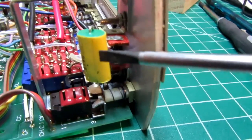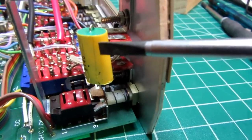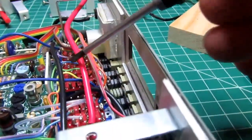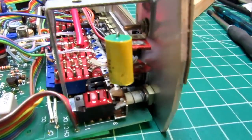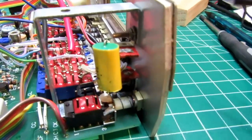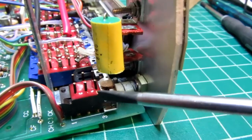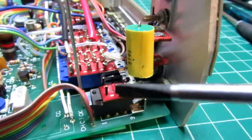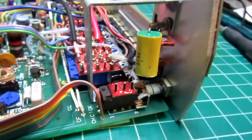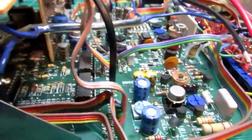The capacitor here is used on the input when you're in voltage mode — AC or DC volts. In DC mode it bypasses this capacitor; in AC volts mode, the capacitor is in series with the positive lead so that any DC component of the signal being measured is blocked, meaning you only measure the AC part. There is a power switch that switches the battery voltage — or DC from the AC adapter if plugged in — and it goes via a ribbon cable to the back of the meter circuit.